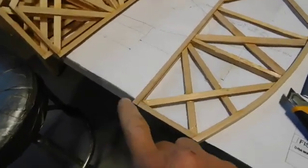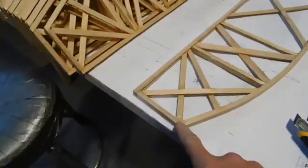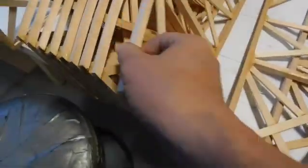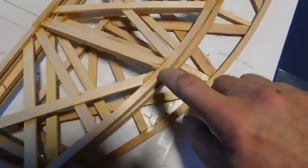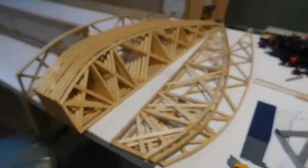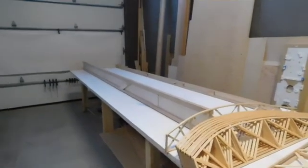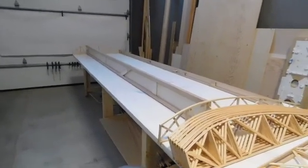I don't know about other people, but when you form them in the jigs, all the glue settles to the bottom and there is glue to sand off and chip out because you put too darn much on and you get clumps of it. So I'm going to sand all those clumps off, get it sorted out so that it's nice and smooth and the big chunks are out of there. That's the job for today, is getting those sanded and in good shape to fit the ribs to the spars and make wings.